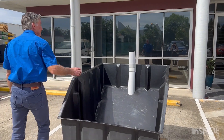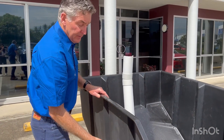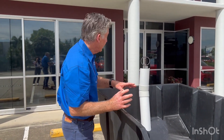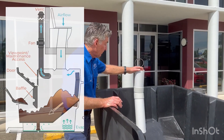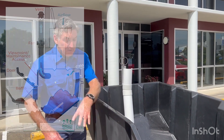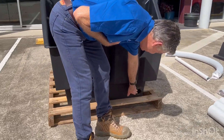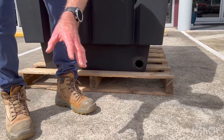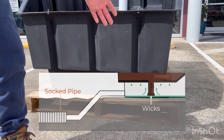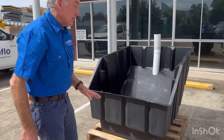The next feature is venting. When you install your vent pipe, there will be a vent coming out of the side or front of the tank, wherever you might install it. This allows air to be drawn from the bottom of the tank and up through the vent pipe. Another feature is the excess fluids drain point — that's here. That drains out into your absorption trench, which you need to install, 1.5 meters long. There's not much that comes out of the drain, but you need to install that.